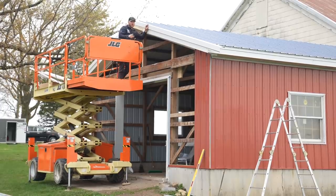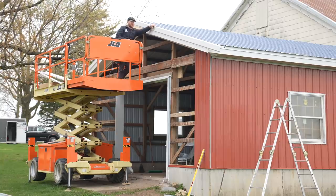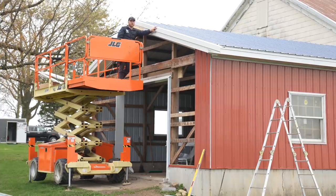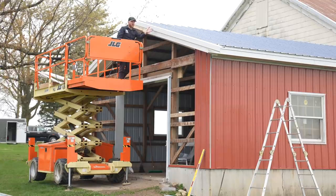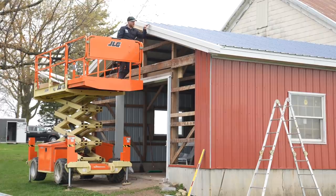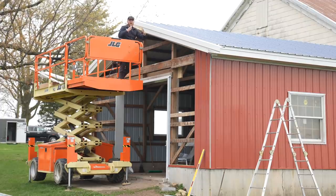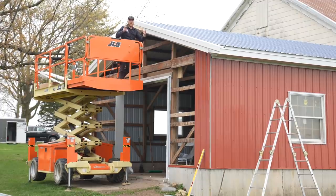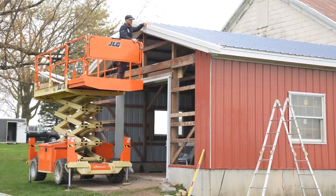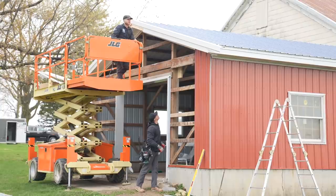You know, so here's a secret for you. When you're remodeling an old building like this, an old house, whatever it is, the lines, the edges, these trim details, those are the things that people see. So if these are straight, the building will look straight. If your walls have a little bit of bow in them, if they're not perfectly straight, you don't really see that because your eye isn't attracted to the middle of a wall. These right here, they got to be good. Our corner trims, those got to look good. So all those lines on the edges that define the perimeters are what people see. So just think about that. If you're going to remodel, spend your time on these trim details. The middles of the walls, you're just never going to see, and it's probably not worth fighting sometimes.